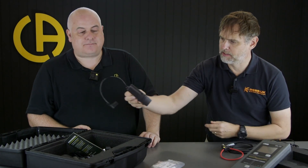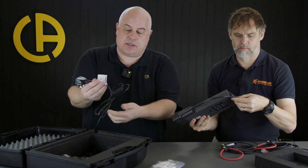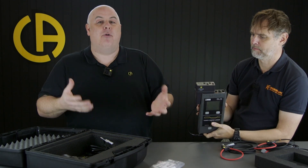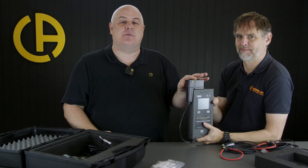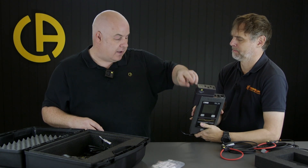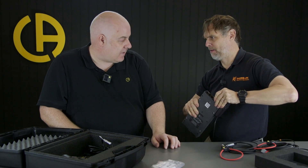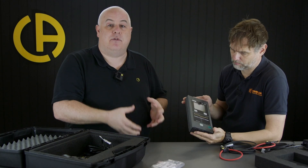What's this gadget here? That's an interesting little bit we've included - it goes into your ports there. The normal way of running a PEL is off just a figure-of-eight lead and you power it in the bottom of the PEL off that lead. Now sometimes, particularly with commercial or industrial installations where you want to do your logging, there might not be a three-pin socket. So with this, we can actually use the mains adapter to power the PEL from the circuits under test. We connect the voltage leads up through the mains adapter and it taps those off and connects into the PEL. The PEL does need to be powered during the logging session. There is a small battery in there, but that's just for short brown-outs and black-outs - to keep it running while there's a power disruption and to record the fact that there was a power disruption, not to actually power the instrument for the whole maybe one-month logging period.